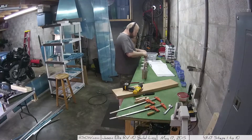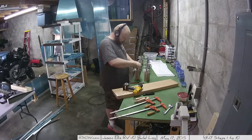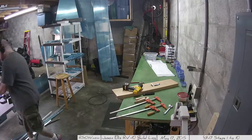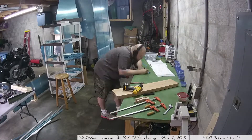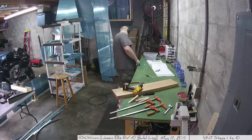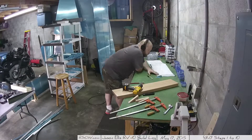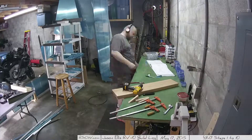What I was doing there is bending down one edge — the bottom edge. You need to bend it ever so slightly, and instead of using a jig I just bent it down with my fingers. It came out perfect; I was actually surprised how well they came out. Here I'm going through with the right and left trim tab horns, which are the pieces that are riveted onto the bottom.